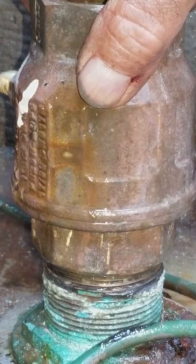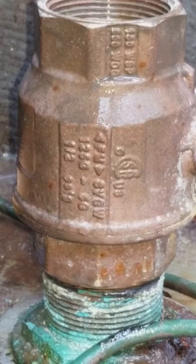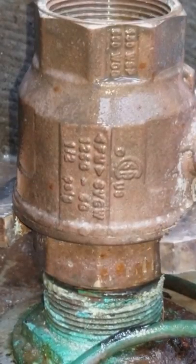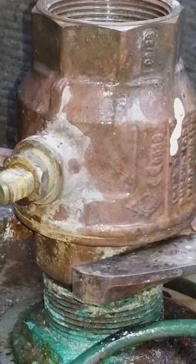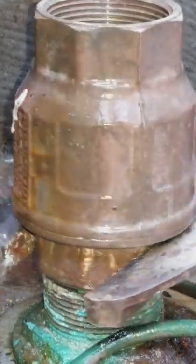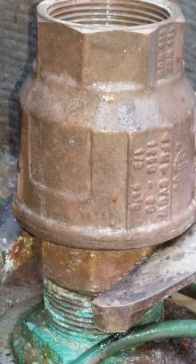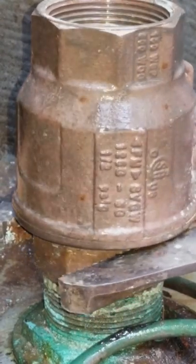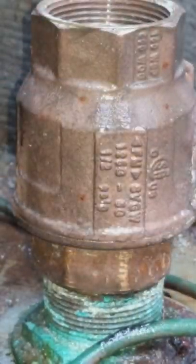Approximately four cups of water — really that's about it. Now I'm screwing on the new seacock. This is the old damaged one right here. I'm gonna go ahead and screw this on tight enough to where we can get to the handle. It's important that you put this on good enough to where you can get the handle straight up and down with no leaks. That's tightened up good enough — you don't have to over-tighten it.